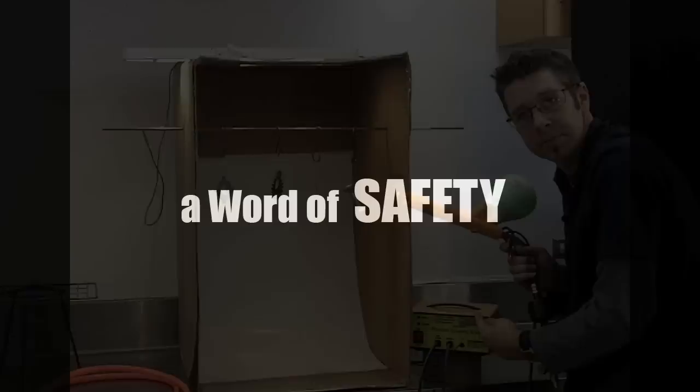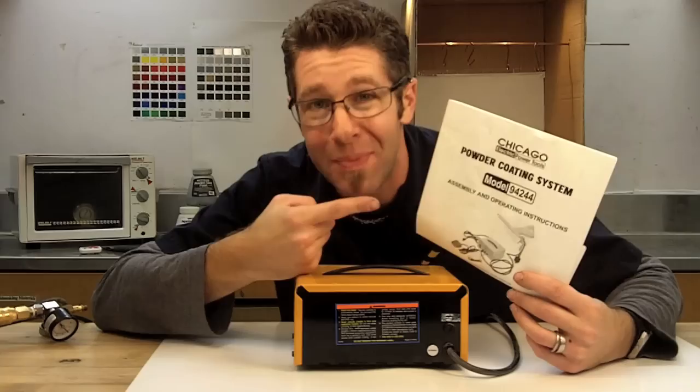The first safety concern of powder coating is electric shock. Be sure to read your machine's manual and safety labels. The gun can generate a seriously healthy voltage right at the tip. Be sure not to put your hands anywhere near the end of the gun while the system is plugged in